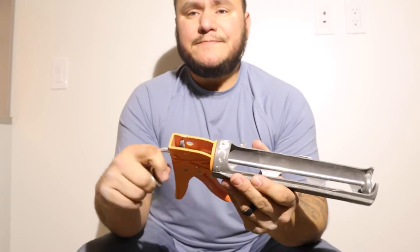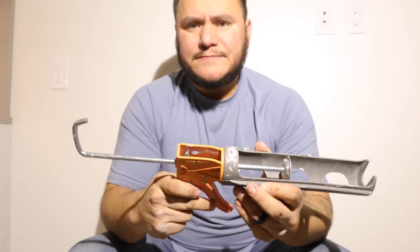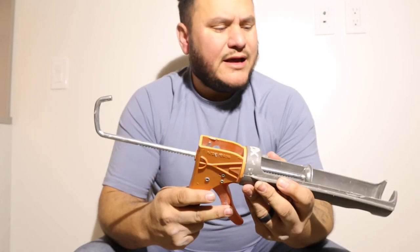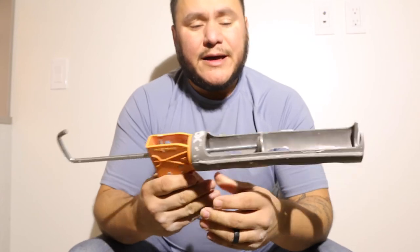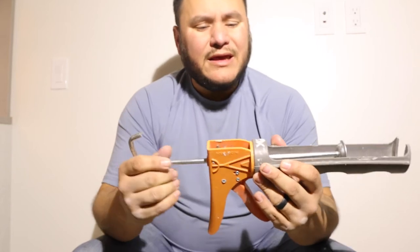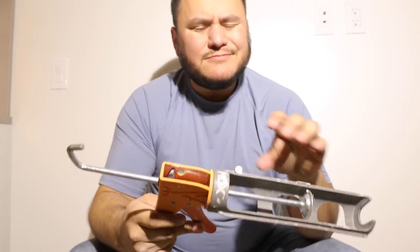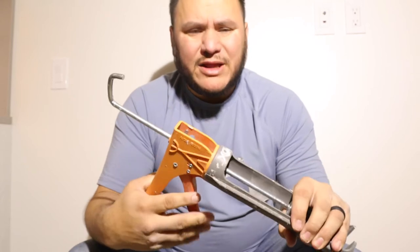This is what we're going to use in today's video. So what else do you need? You've got a couple of things — you can use the dripless caulking gun. Now it's more for beginners. It doesn't provide as much flow, but it does help once you're going — it kind of retracts back a little bit on the pressure so it doesn't drip out of the end of your tube. I don't like using these; I don't really recommend them. It doesn't give you enough flow and it restricts that, but if you're new to caulking, give this a try.